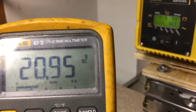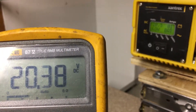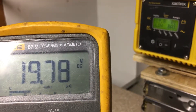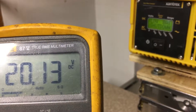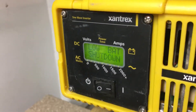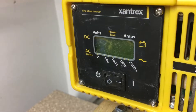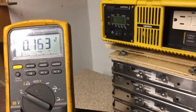There's the low battery alarm — it's saying hey, batteries are low, which is exactly what we want. Now let's go a little further to trigger the shutdown at 20V. Backing it down a bit more... batteries wearing down, going right to 20V. At 19.8V it went into shutdown — low battery shutdown confirmed. So you can see that this inverter is perfect for what we need with this battery configuration.